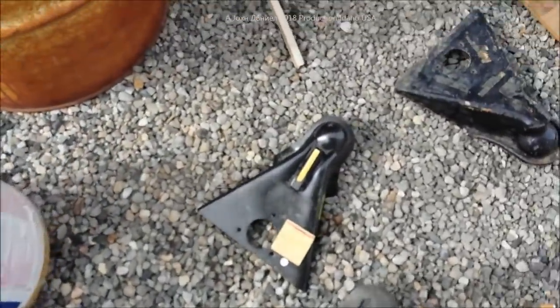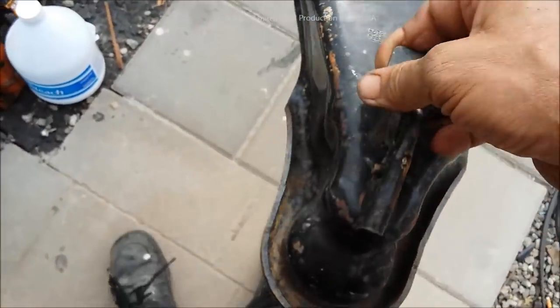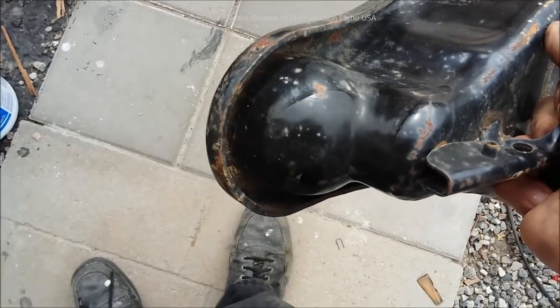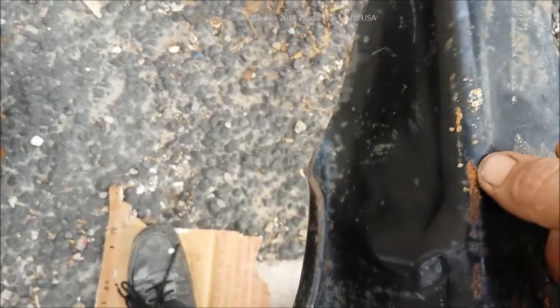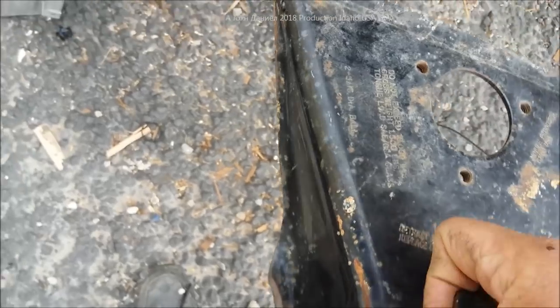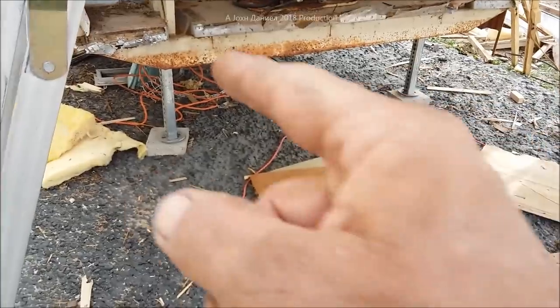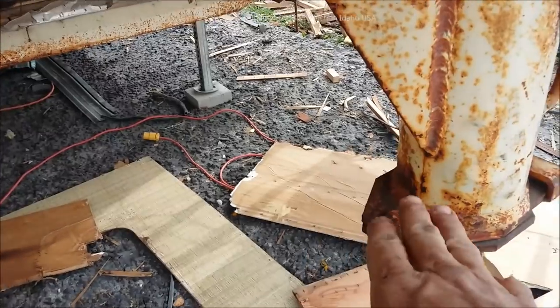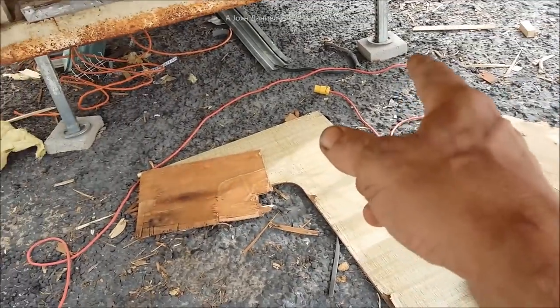Now what we have is some 2 by 6 box metal that is 3/16 wall, and one of these real nice heavy duty, this ain't the cheapie, you see that, very heavy, 3/16 plus, because it actually measures over 3/16 hitch for it, and we're going to mount it right in here on both sides. And currently for the pickup truck, this comes all the way out to what would be the center of the pickup, and 14 inches back will be where we put that hitch right there.